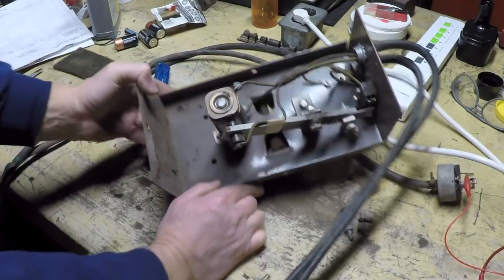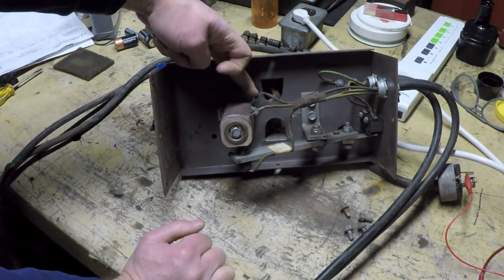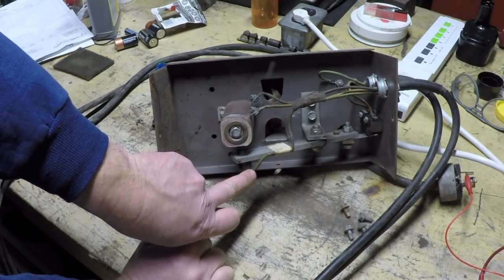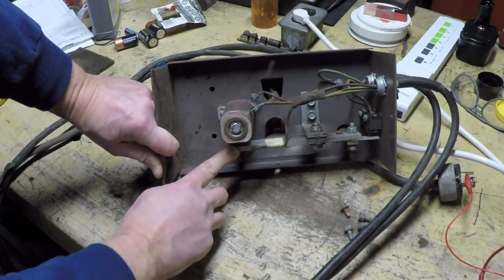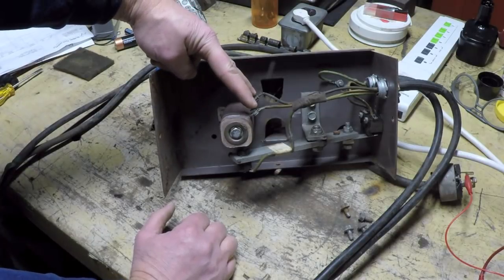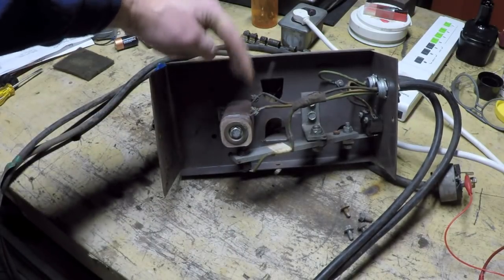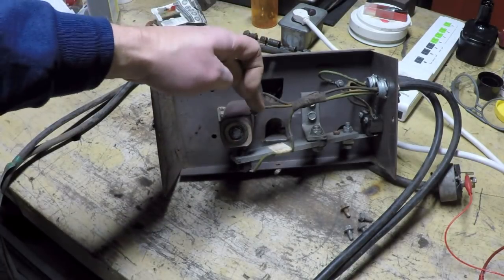So in other words, you've got three connections here. You've got a wire at one end, a wire at the other end, and then a wire on the wiper. This one is called the tap, because the tap is the one that moves, varies. To test this device, the first test you want to do is go right from here to here, and you should have a fixed resistance. If this is open, if you get infinite resistance when measuring from here to here, this device is bad.